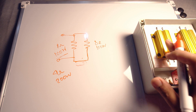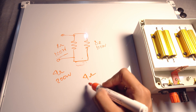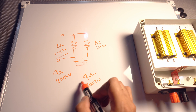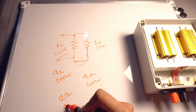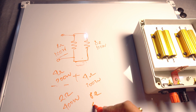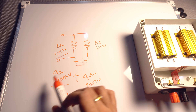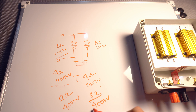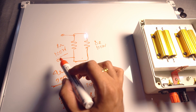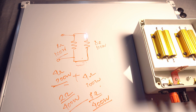That's one pair — the same goes for the other pair, so we also have 4 ohms 200 watts from that end. If we then parallel these two, we get 2 ohms 400 watts. If we put the two in series, we get 8 ohms 400 watts, since for a particular current there will be a particular voltage drop shared across the two. So the different possibilities we can get from this system are: 8 ohms 100 watts, 4 ohms 200 watts, 2 ohms 400 watts, and 8 ohms 400 watts. Let us move into the connections now.